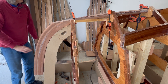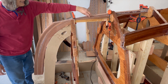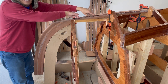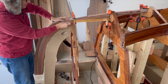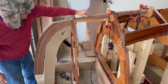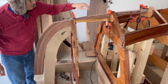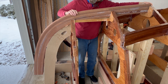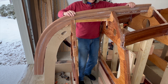I've got the top done and I'm going to profile this. Because there's going to be amine blush from the polyethylene, I'm going to lift or pick all this up, really sand it out to get rid of the amine blush, and re-epoxy it down. I have to decide how far in I'm going to clean this up — I can't cut the stem too far. I'm glad I uncovered some of this polyethylene in here, and on the backside I was able to get all of it out.